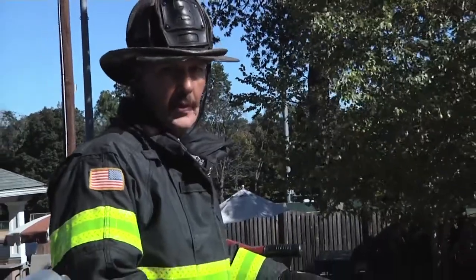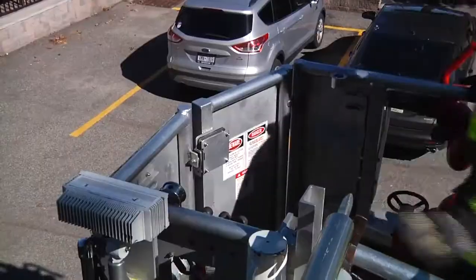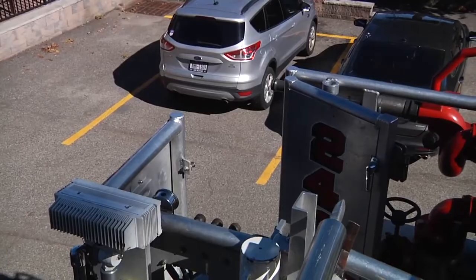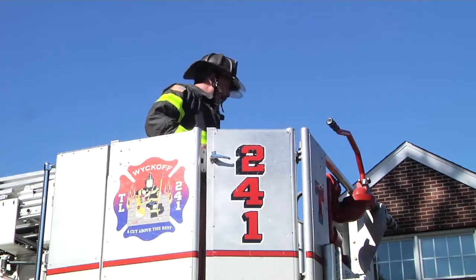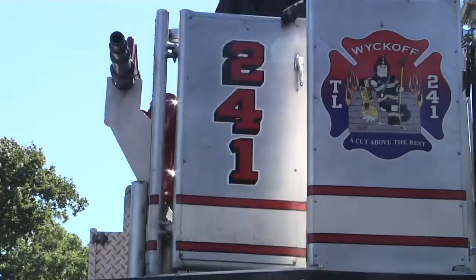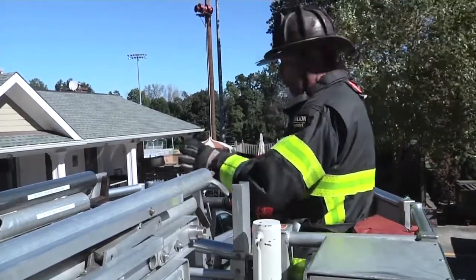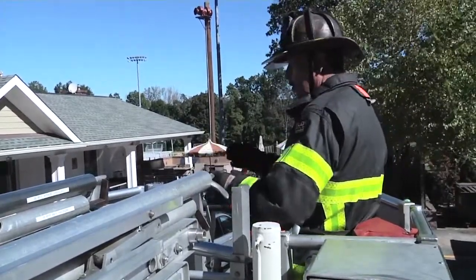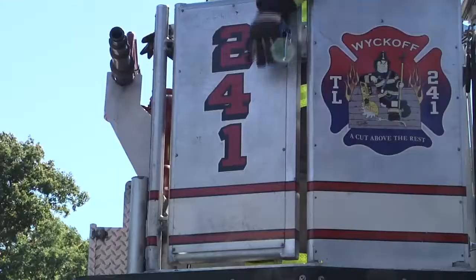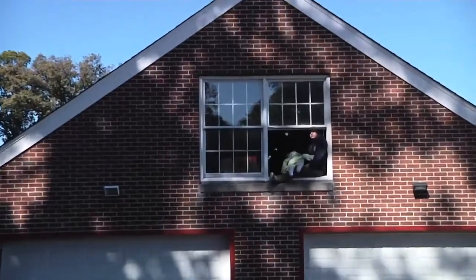One other tactical tip: if you have a stationary control and you're flying to the opposite end, I like to open this door up and leave it open. As I'm flying, I have full visibility to the victim. I can come up out of the cradle and start moving. When the door is closed, I only have a little inch spot each way. If I'm in smoke, trees, going through some obstructions trying to reach the victim, I might have to have full visibility. So if I open this door as I'm flying, I have full visibility to the victim.